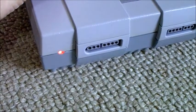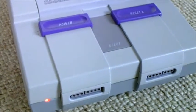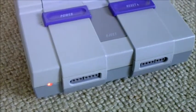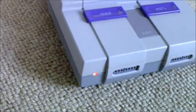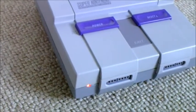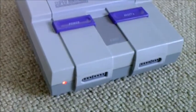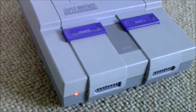We've got my little connector there hooked up to the Mega Drive Mark 1 power supply. And if we turn the power on — there we go, we've got power! I've not actually hooked this up to a TV because this Super Nintendo has video output issues, so nothing is appearing on screen. But that just goes to show it is getting power to the board. I'll put links in the description to where I got the parts — they're pretty cheap on eBay. This is a cheap and easy way to get your US Super Nintendo powered here in the UK. Thanks for watching, guys.